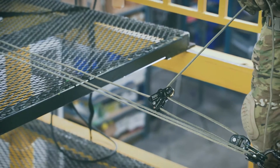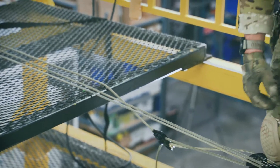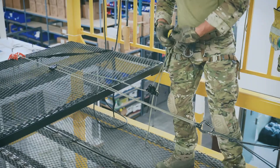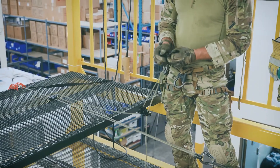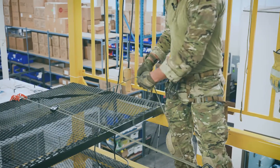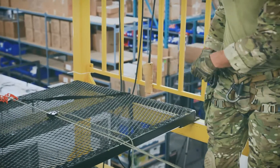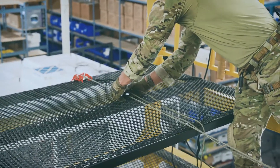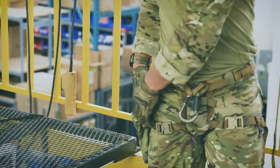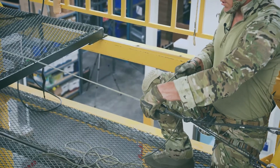You can continue that until the load is up. The transition from the haul back to the lower is pretty simple — just dismantle the system: take everything off except the QD. Take the two QAs and the Prodigy off, and you can lower your load under control.